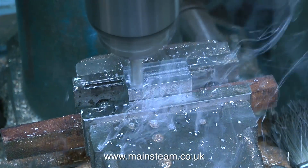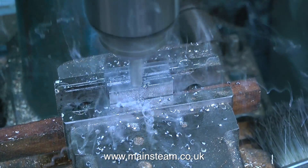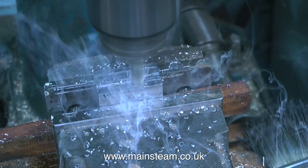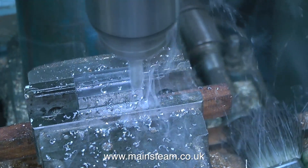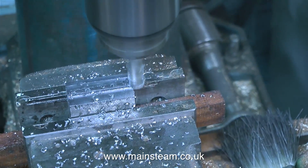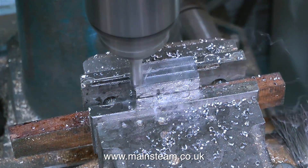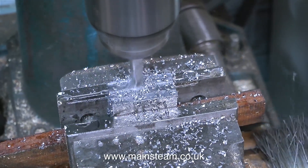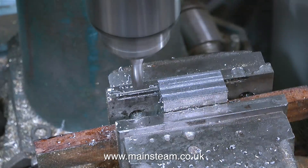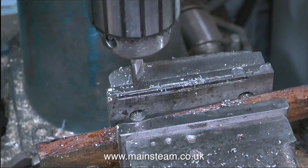Although I must add that if I was doing an important piece of milling, like on a casting, I would probably use the milling chuck. This is quite a nice effect — it looks like something from a science fiction film. All I've done is put some 3-in-1 oil on the top surface, and as the metal chippings coming off the steel are very hot, the oil smokes, just like you can see here. The effect is even stranger if I speed up the video. I must confess that I'm guilty of not applying sufficient cutting lubricant to pieces of metal that I'm cutting, either in the lathe or in the milling machine. This smoke coming off the parts can't be good, because obviously I'm breathing it in.